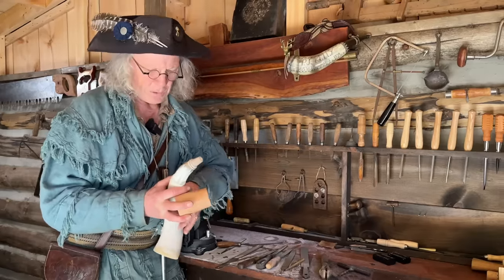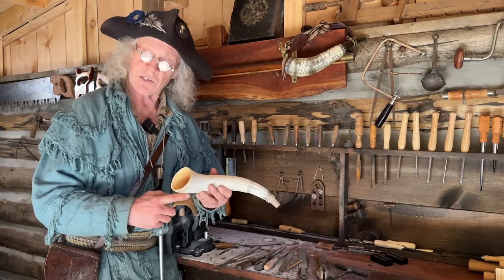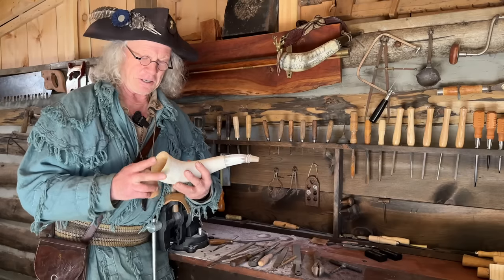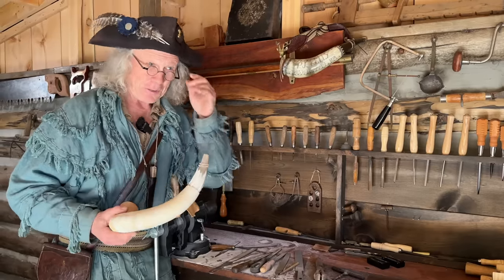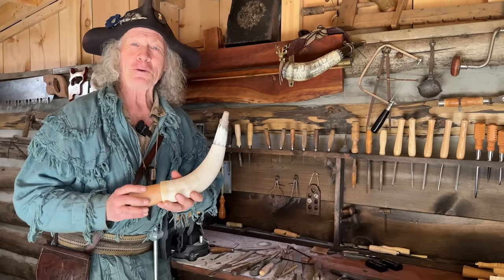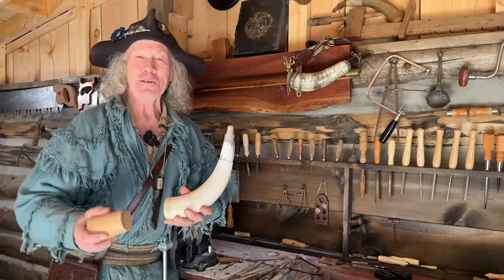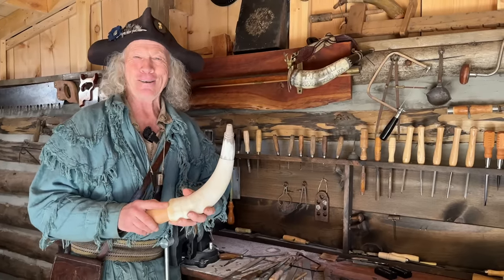Yesterday I turned out a fitting block, or a sizing block. The next step is to heat up the base of this in some hot oil, which will make the horn flexible. Then I fit in the block, which gives it a rounder shape and makes it much easier to get a good seal on the horn. And when I'm talking about sealing the horn, they have to be watertight — not just from rain as you're carrying it, but from humidity. At one black powder shoot, the hardcore guys had to take the powder horn off and dunk it in a barrel full of water. If the powder was dry afterwards, they could go into the shoot; if it wasn't, they were out. You could get eliminated before you ever primed your musket.